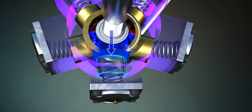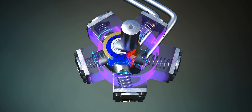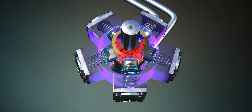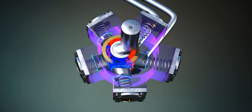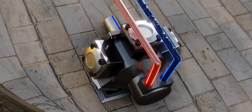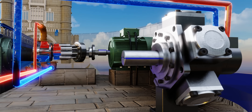When the piston movement is repeated, the central block completes a full circle. At the outlet of the motor, the liquid with low pressure is collected. This hydraulic motor is specifically known as a radial piston hydraulic motor, and one specialty of them is that they rotate very slowly — between 100 to 200 rpm.